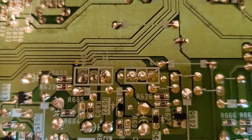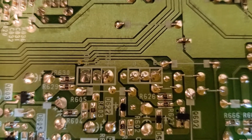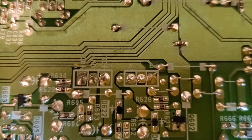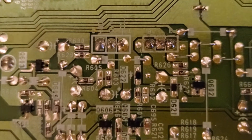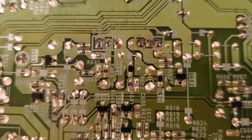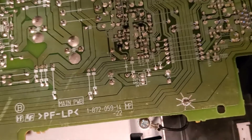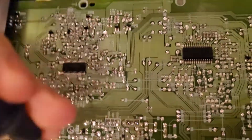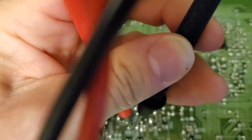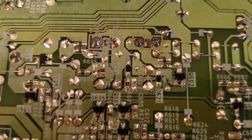But the fan never turns on. Instead, the protect pin drops from about four volts down to maybe two volts. With the protect pin desoldered, the unit stays on, but with it soldered in, it triggers the shutdown. Looking at the fan connection, I can follow it down to capacitor C601, and if I take the meter across it, it's almost a dead short — nearly one ohm.